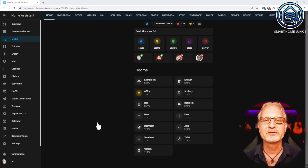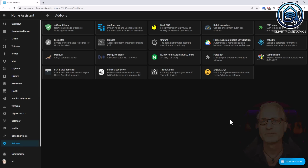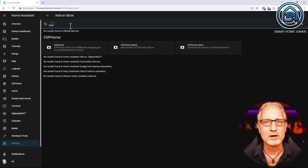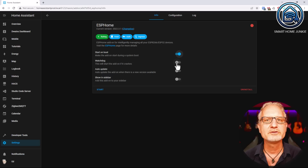To begin with, we need to make sure that ESP Home is installed in Home Assistant. I already installed it, but here's how you can install it. Go to Settings, Add-ons, and click on Add-on Store. Now search for ESP Home. Open it and click Install. Now check all the options and click Start.